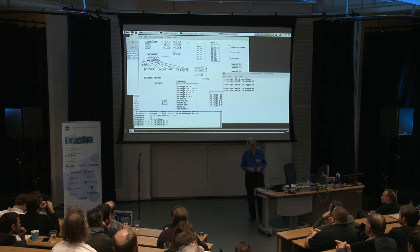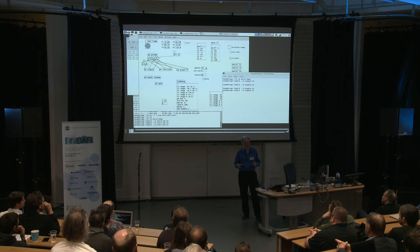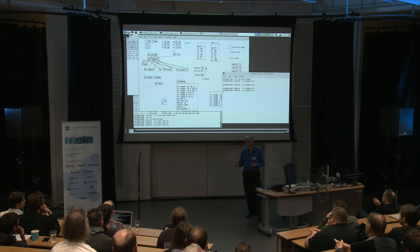It consists of a Leap Controller, which is a thing that tells the computer down to, I believe, millimeter accuracy where all the joints of your hand are, which is 57 numbers. And then you can map them any way you want. What I have done is map them to three coupled oscillators, a little bit like the old Buchla synths, but all three trying to sync each other, which looks like a flow on a three-dimensional manifold in a way. And then you get to change the shape of the manifold, which of course maps rather nicely to changing the shape of your hand. So you get a sort of a hand gesture to timbre converter. Right? And the best thing about when you couple oscillators like that is you have no idea what they're going to do. It's like trying to play a violin.